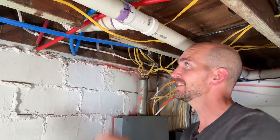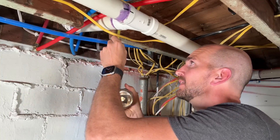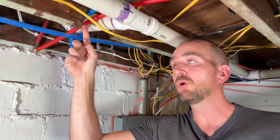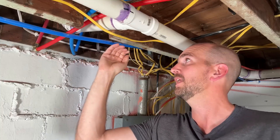I have an issue where a two-by-eight floor joist was called out in the inspection because of a notch. The notch is about five inches by roughly three inches. What that does is it removes the ability of this floor joist to carry tension at the bottom, and that's what was flagged in the homeowner's inspection — the structure of this joist is no longer valid.